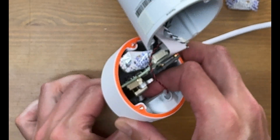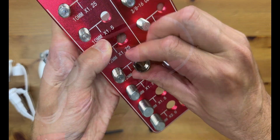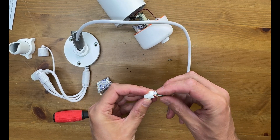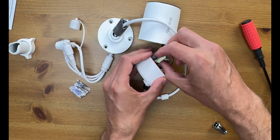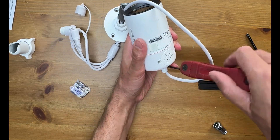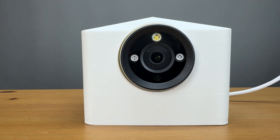Let's open up the camera and unplug the wires. I can now feed that little plug out through the hole in the back of the camera. Let's remove the seal and the ball joint — I measured the size of this ball joint and it's a 12 millimeter fastener. After a quick 3D print, I have a short piece that will slide on over the wires. Next, replace that rubber seal, feed the wires back in through the camera, and plug in the clip. Now we can put the camera back together — feed in the wire seal and tighten the 3D hollowed screw to create that weatherproof seal. Now when I install the camera into the mount, it fits great and I actually have a little bit of room to spare. This thing looks amazing — I couldn't be happier with how this project is turning out.